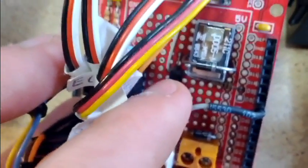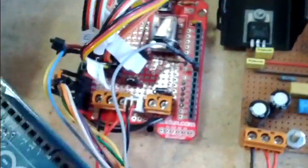That's where all your servos plug in — they're all labelled with little tags. That one says 'base.' There's a little filter cap on the servos, just a little electrolytic placed across the power rails to minimise noise. Then we've got a little 5 volt relay which energises and de-energises the electromagnet. There's a diode to protect the transistor from the switching of the relay, and a diode down here to protect the relay contacts from the induced voltage spike from the electromagnet.